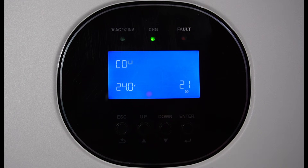This is my DC cutoff voltage. If the power supply source isn't available, the inverter will shut down. My inverter will stop creating power at 24 volts, which is the bottom-end voltage of my lithium batteries. Solar power balance — when enabled, solar input power will be automatically adjusted according to the connected load. If the batteries are fully charged and there's enough sun to run the load, it will adjust the solar power going to that load.